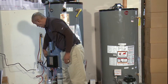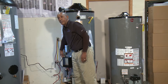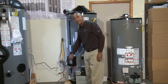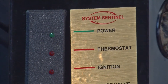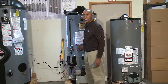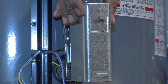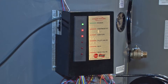There is a power button on the side of the box, so you don't have to keep unplugging it. Each unit is supplied with an on/off switch. When you turn the unit on, the first thing you'll see is a green power light, and immediately the thermostat light should come on as well since the thermostat is calling for heat. The thermostat is turned all the way down and there's no water installed, so it will call to fire.